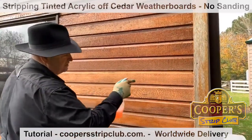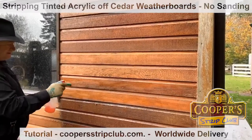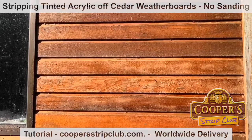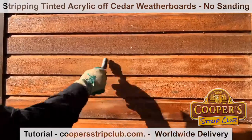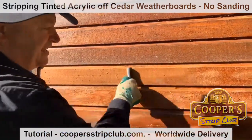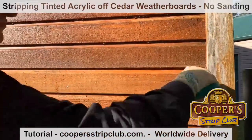We're going to leave this for probably five minutes to soak. We're looking for the finish that's in the grain itself. Often you'll think you've got it all out, but the stripper goes into the wood. Being pH neutral, it's not going to damage anything, but it drags out the finish that's deep in. When the first coat of finish was put on, most of it just went in deep - and this is the one we're getting out now. This is probably the most important one to get. You want your new finish to succeed, so getting rid of what's in the grain - be it paint or another oil - is critical.